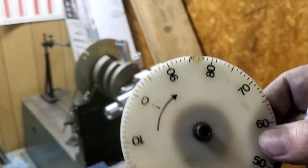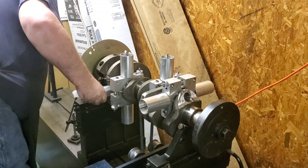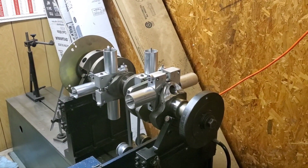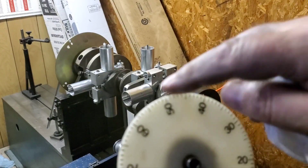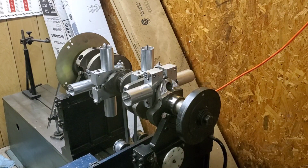I've talked about this before. I usually like to have the front — I've got a proximity scanner back here. The light is triggered. You can see the red light. So that means the crank is straight up. I usually have a trick to find out where it's zeroed out. I try to have the rear counterweight between 90 and zero and the front between 40 and 50. As you can see on the wheel, that puts it at 180 across. That's why when we static it, it subtracts. Our rear counterweight is heavy now, the front counterweight is heavy, and we're good to go. I just thought I would add that. Thanks for watching.